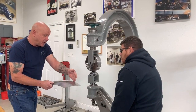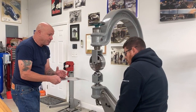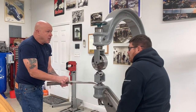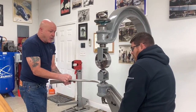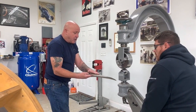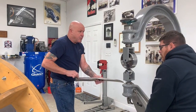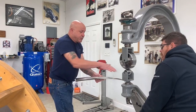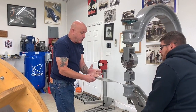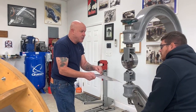You're going to wheel a little closer to the edge now, and you're going to try and get that as nice and blended as possible. Okay. And then we're going to run with the slightly wider flat top, and you're going to put some shape down in here, which is then going to take care of this waffled edge, because you'll have shape coming in. But the difficulty would be it will start going like this if you put too much shape in it. And if you run with a flatter top wheel over to the edge, you're going to flatten all the shape that you just put in.